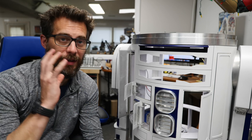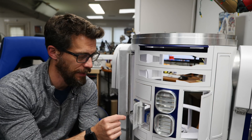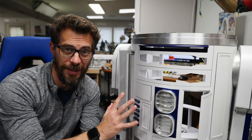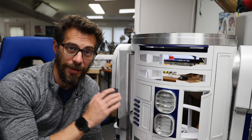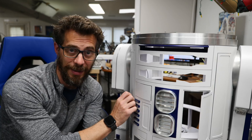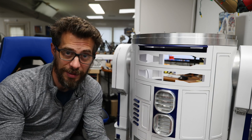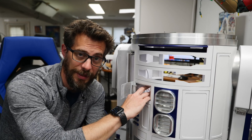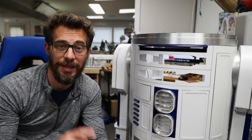For the past several weeks, I've been working on the hinges on R2-D2, and it's been surprisingly difficult to get all these hinges for these panels in the right place so that they can clear the body as they open and close. Because all of these hinges have to work on a curved surface, the hinge geometry is kind of interesting. Unfortunately, I had to cut out a lot of the interior structure to make room for the hinges. So now I have to go back and trim all these pieces up so that they will fit around the hinges and put them back inside. I also have to go back and add a servo and a mount to each one of these doors so that the electronic system can open and close them remotely, and build a back panel in each one of these cavities so that you can't see straight through them when a door is open. But for now, these hinges are done, so I'm going to move on to the hinges on the dome.